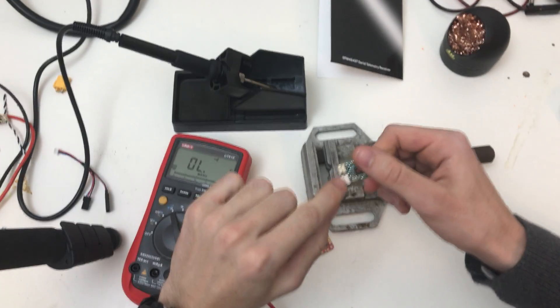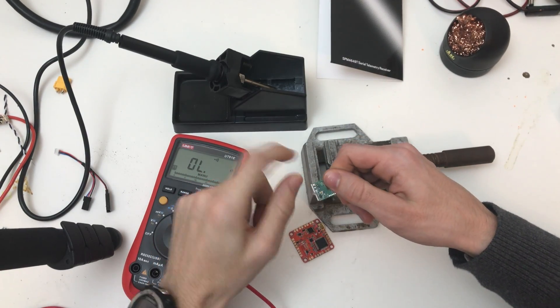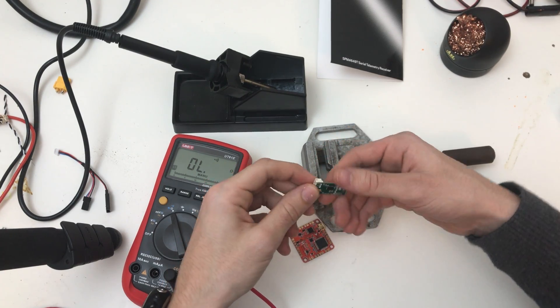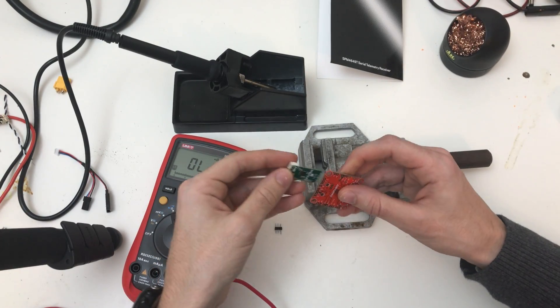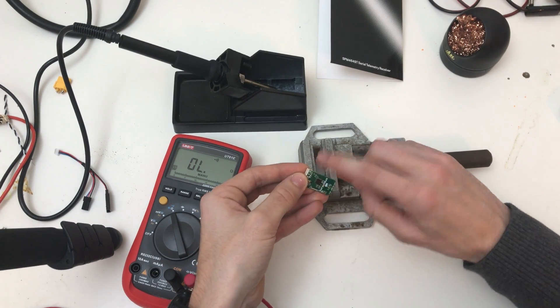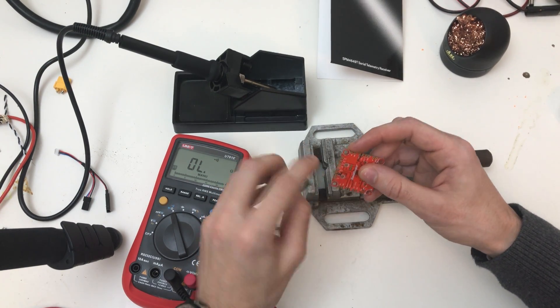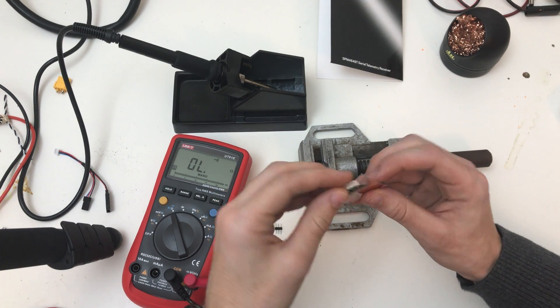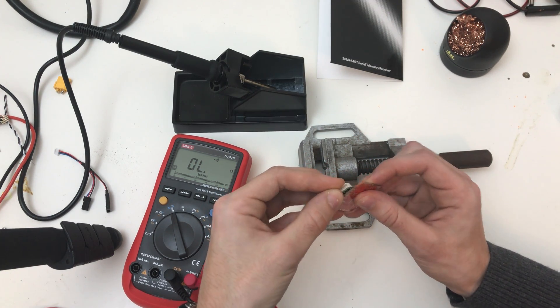Yeah, and that's the dead one I'm not going to use. So let's recap: we have five volts here, ground here, and signal — bidirectional — here. So now we're going to remove this connector, desolder those four pins and push it down, and then hopefully we can stack it like this. The signal goes to UART3, the TX pad here.